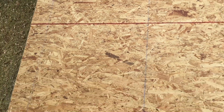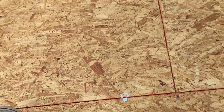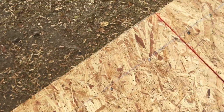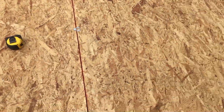Here's a video to show all the nail spots that I've nailed off the plywood. I'm going to have 6 inches on the side and 8 inches on the seams. All the seams on the edges, showing all the nails. The whole deck's done like that.